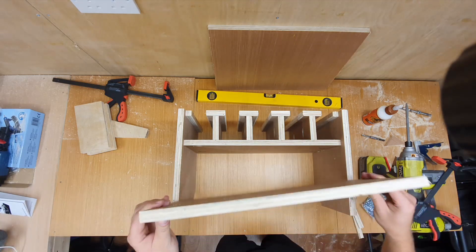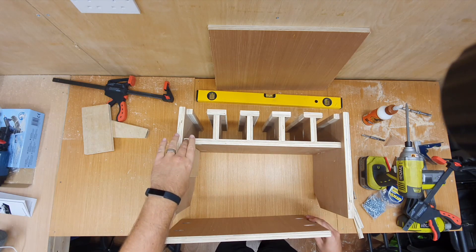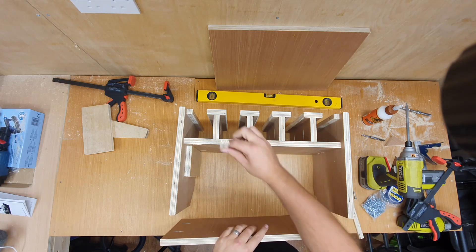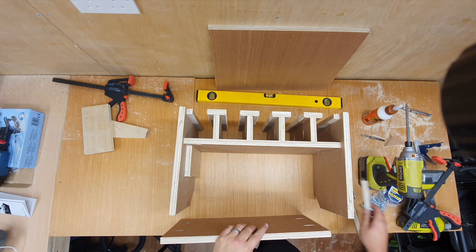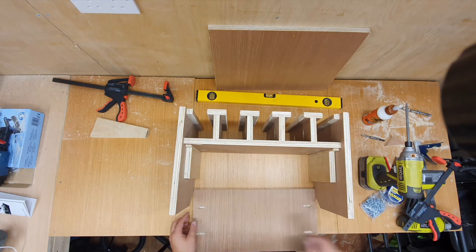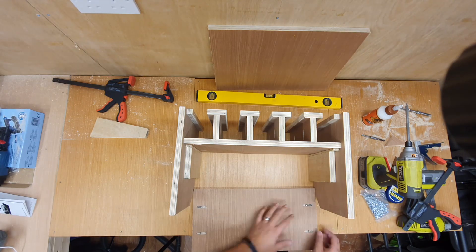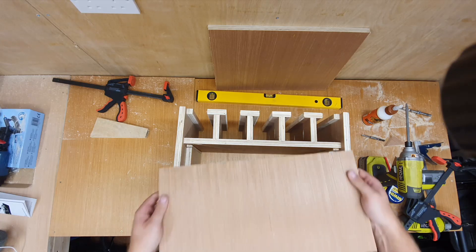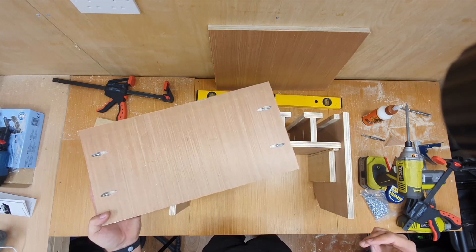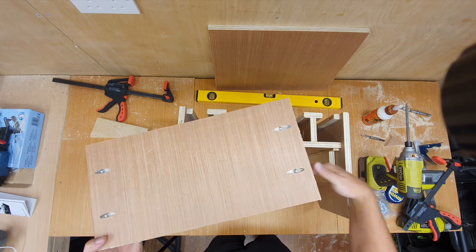What I'm about to do now is fix the final shelf and put that in place. I need to allow for the depth of the drawer so that it can slide in and out, so I'm going to use those as guides with a little bit of a packer to allow for some space for moving in and out. I'm trying to keep the pocket hole screws hidden, so they're going to go inside and we'll fix this from the gap for the drawer.